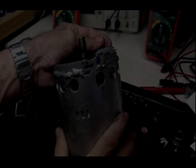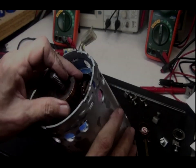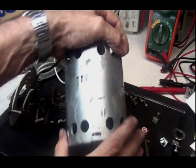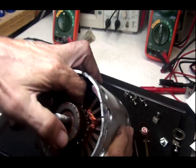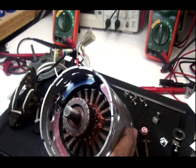All right guys, this is the Bosch that I have shown on a previous video, running it with a small battery. I took it apart and took all the windings off, and it was pairs — north-south pairs — and I'm going to redo it with all north groups.